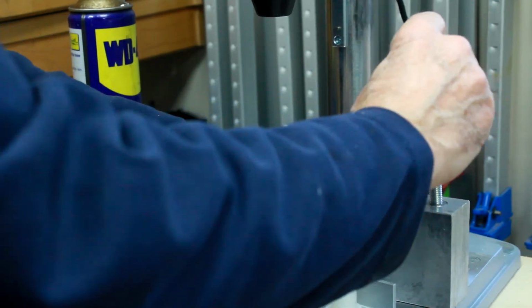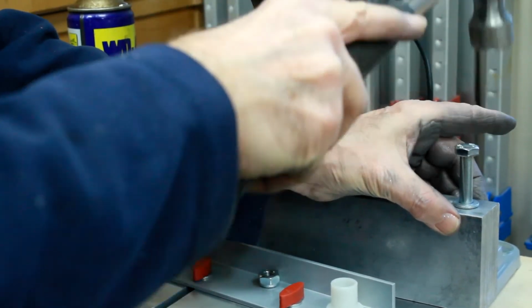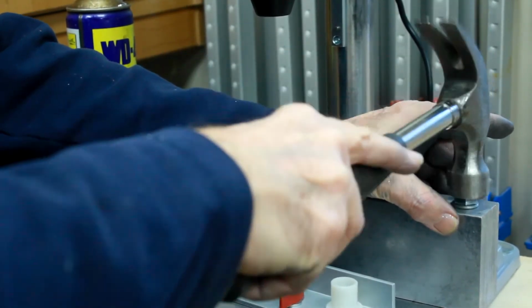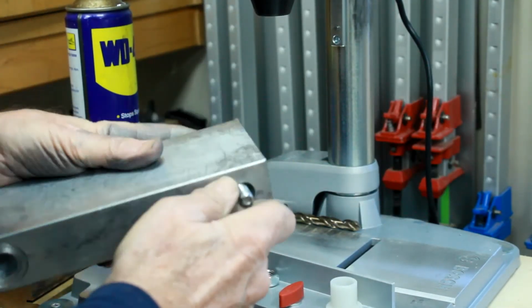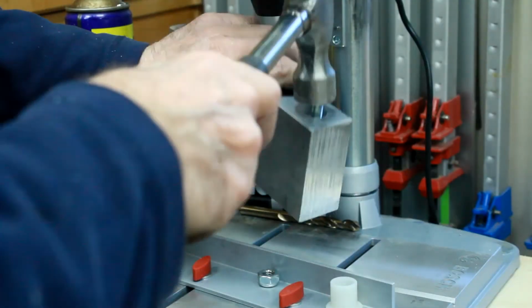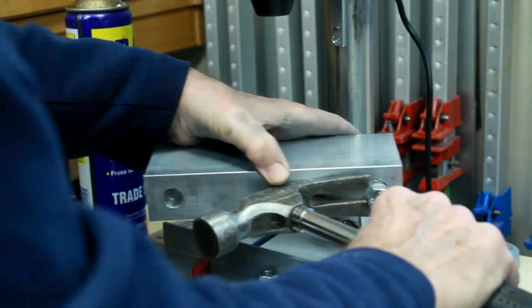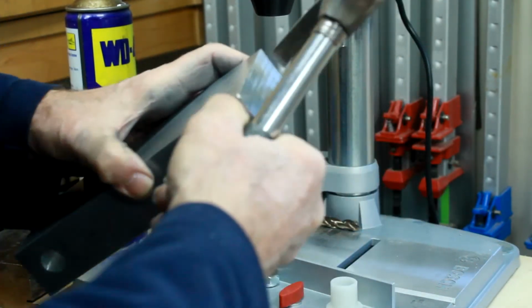I've still got to cut the billet up. That should give me a nice snug fit for the kingpin, with room for a bit of easing up later, but that's fine. Shouldn't need what I thought, which was that they'd need to be glued in. I think they can probably be a press fit.